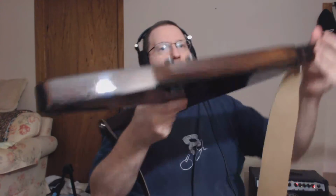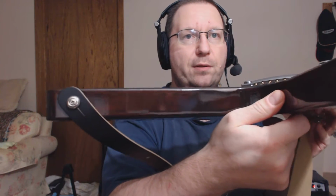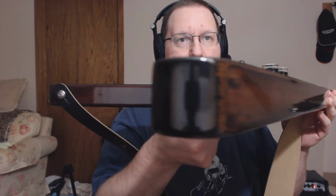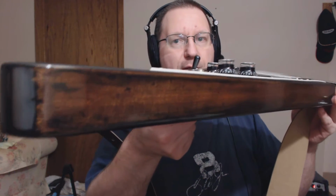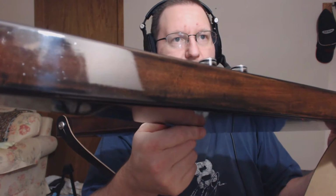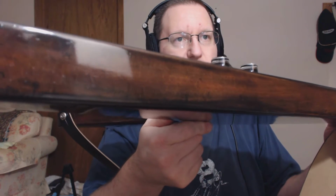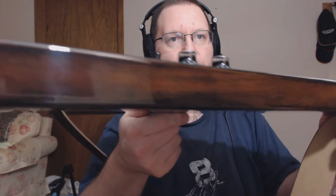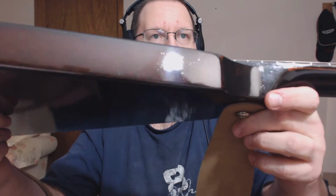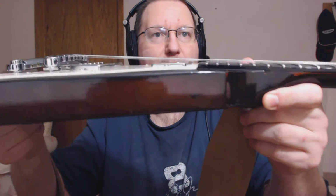You can still actually see the original wood down the sides and in the tail a bit, though it does look a little bit darker in the tail, but that's because of the light. Again, just put 3 coats of poly on just to give it a harder shell. But as you can see here, there's some orange peel type crap going on there, but otherwise it's not that noticeable. Some of the stain came off the sides as well, so that was another reason why I did so.